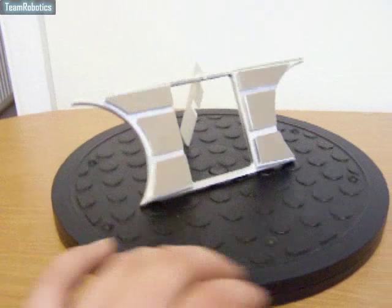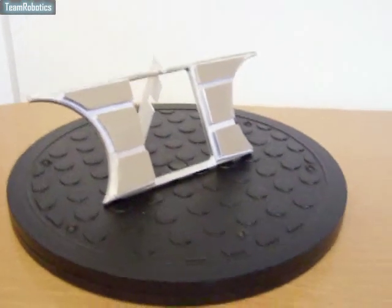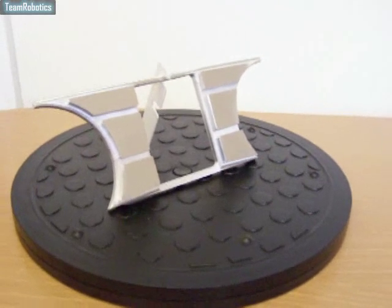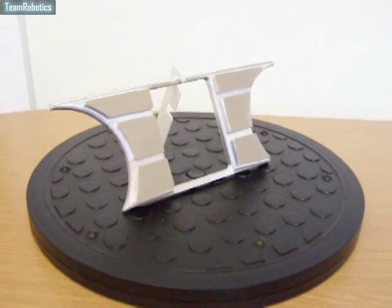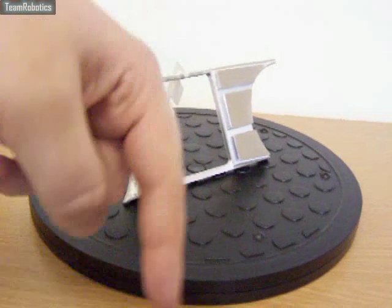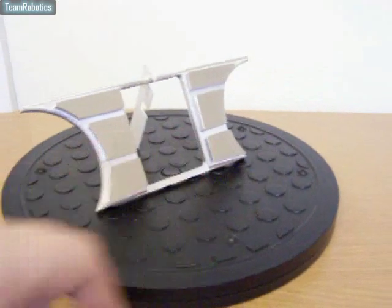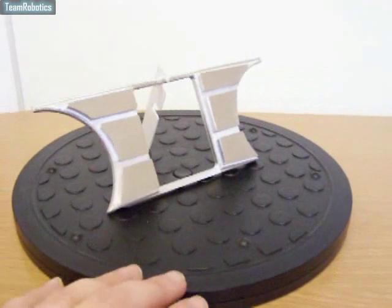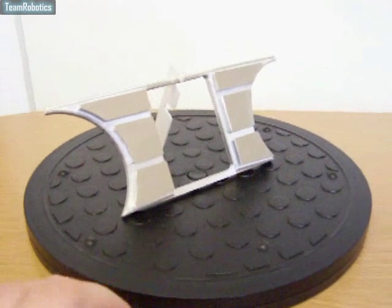The way I've made the block stand out further is when I've brushed the aluminium after to get the finish. The back plate has been brushed vertically and the blocks have been smoothed off horizontally, so that's why you've got a clear definition of the back plate and the blocks.